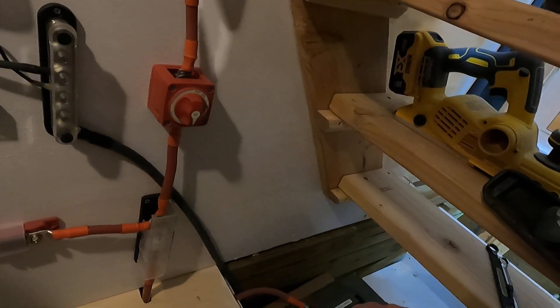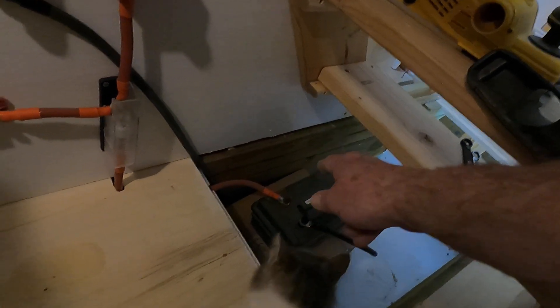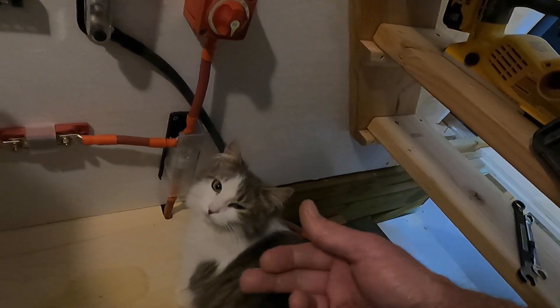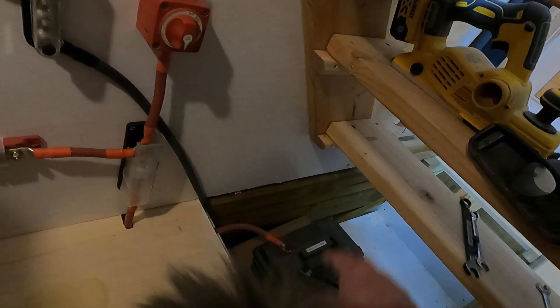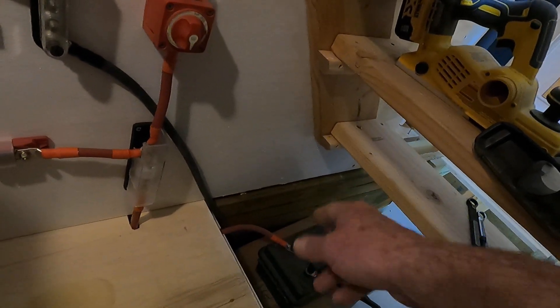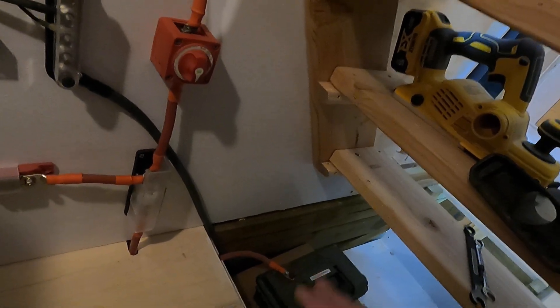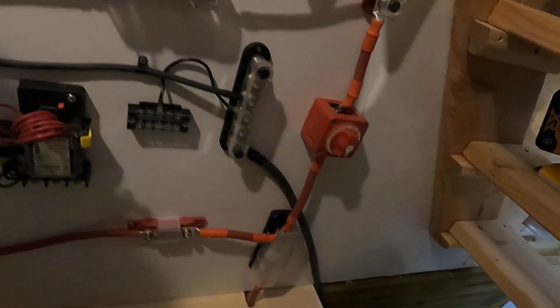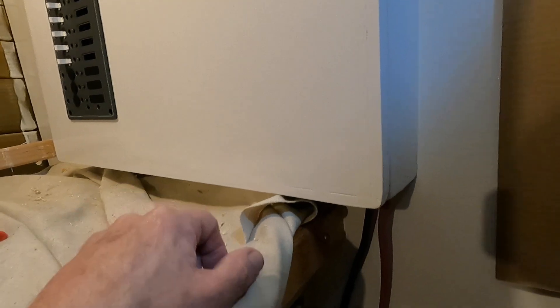In this case, you could have put a fuse right off the battery bank, but I didn't like that, so I've got about 18 inches of wire unfused right there, which is acceptable. It could be better, and I may someday put a fuse right off the batteries — we'll see how much room I've got and how things look down there.